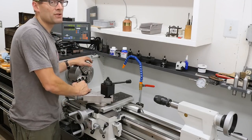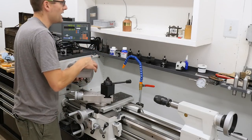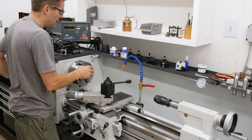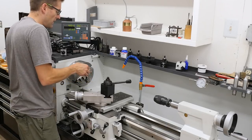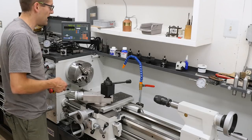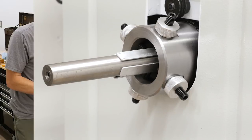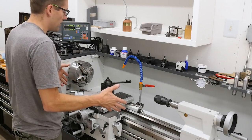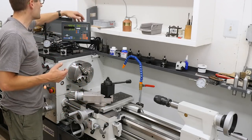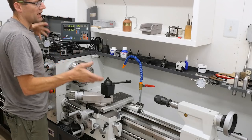It's got a four-jaw chuck — that's an absolute essential. I've got aluminum pads between the chuck jaws and the barrel: they protect the barrel from scratching, and since they are very narrow, they allow the barrel to yaw slightly when you dial it in from the outboard spider side. I built an outboard spider that clamps on with a pinch clamp — turned out really well. This is the kind of machine whose capabilities you're going to need for gunsmithing. I've also gotten used to the DRO, which is really awesome — I would not be without it on a lathe for this type of work.